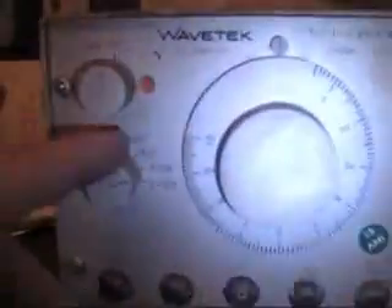Let's tune the frequency up and see what we get — see if we can get this to bounce. I maxed out, so I'll pop it to the next range. Yeah, that's almost full scale. Now I'm up in the 10k range. What I'm seeing is that as I add more windings, I get more copper in the equation and the frequency goes down.